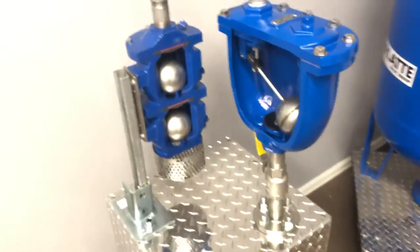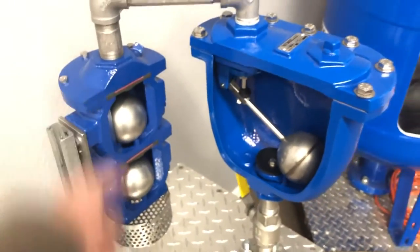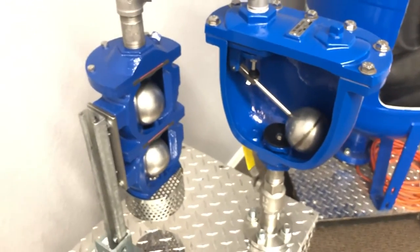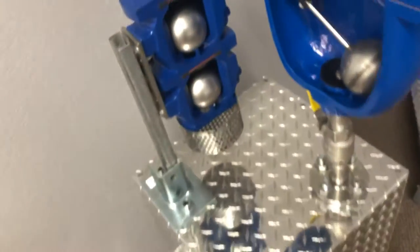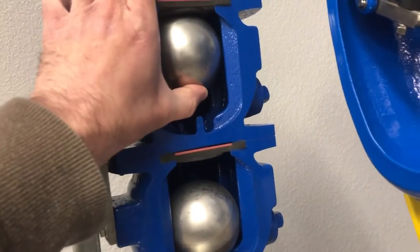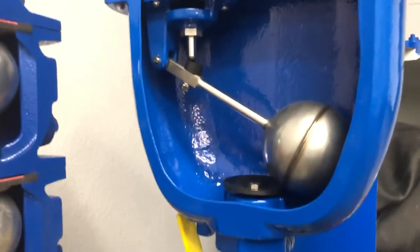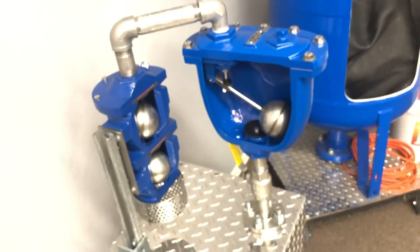Since it's here on our demo, I'll show you what this is — this is a flood safe inflow preventer. If this valve was in a vault that could be flooding and at the same time you have a water hammer that draws a vacuum, the valve could end up underwater and suck dirty water into a clean water pipeline. The flood safe has a very soft rubber seat; if it's underwater, these seal up so that if the vault's flooded and a vacuum is drawn, you're not going to contaminate your clean water line. This is an optional add-on if there's a risk of that.